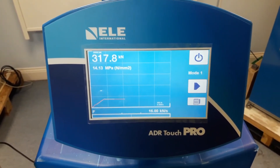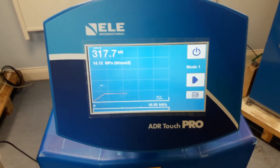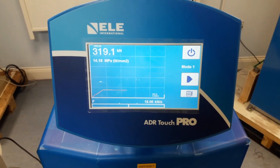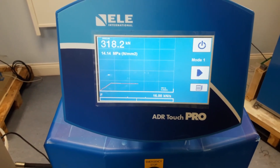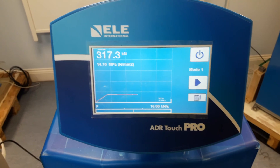As you can see, the machine is now starting to control to the load that we stopped it at. This function is handy for ASTM tests where a stability or alignment verification is required, or for any other reason during the test if you wanted to pause to have a look at the test sample or something along those lines.